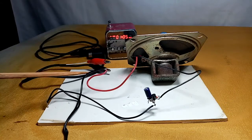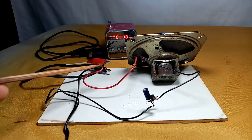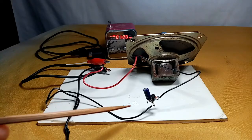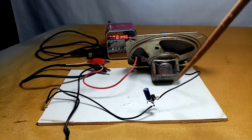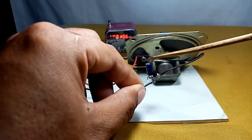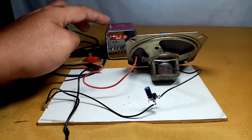This is now the connection, guys. I soldered the supply. This is my connection going to my adapter. This is the supply and this is only 5 volts, and this part here is my B plus 5 volts. This part here is the ground from my ground connected to the amplifier. This is connected directly to the emitter pin of the transistor. The B plus is connected to the speaker and the other wire of the transistor, and the base of the transistor is connected to the positive side of the capacitor. I will clip my signal coming from my MP3 player to the negative side of the capacitor.